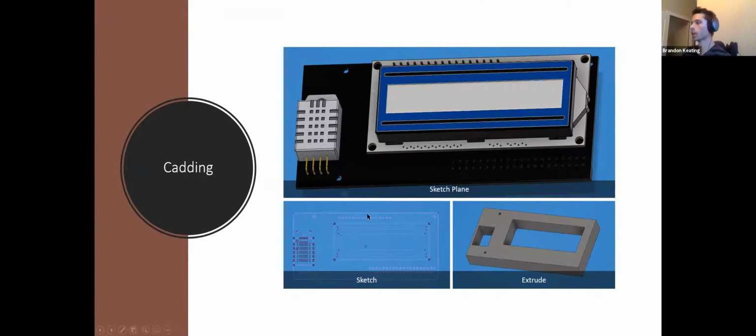So in the bottom left, you can see that I've projected the rest of these shapes. Now, a projection is just to take the physical shape and convert it into a sketch version. So it just makes a 3D, 2D essentially. So once I was able to see everything, I made all of the sketch lines what's called construction. This means they're not going to extrude. They're just there to give you a reference point to what you're actually doing.